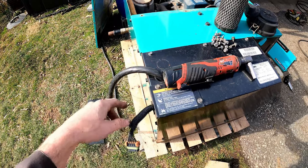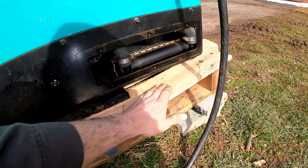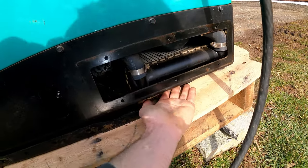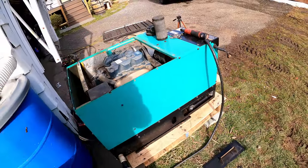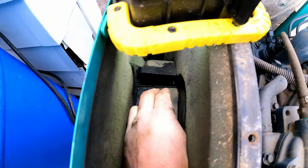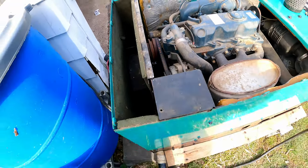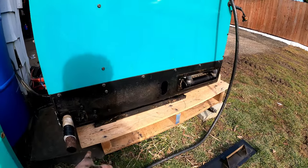Under this cover is your main electrical hookup, and I assume this is for a remote control to power this. One thing I like is that the radiator is on the bottom. You do want to make sure there's no screen or anything blocking it — you want to make sure you don't puncture that. I can feel it's kind of caked up with crud, so I'll have to clean that radiator. It's got a big drum fan right here attached to the front of the crankshaft — it's pulling air in through the radiator, across the engine, and then back out the bottom.